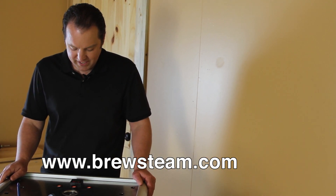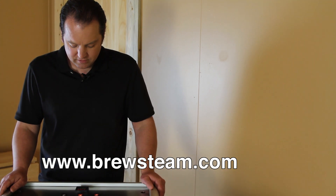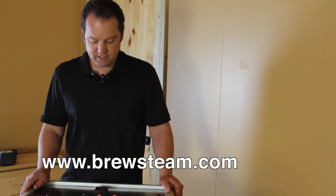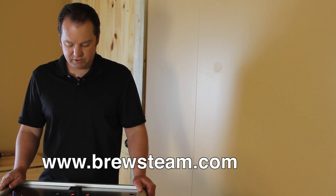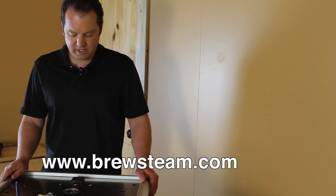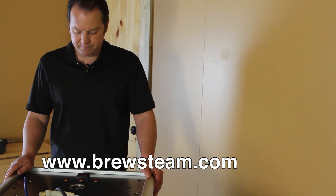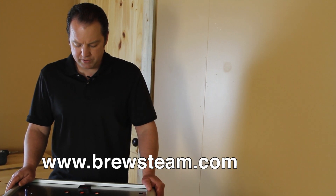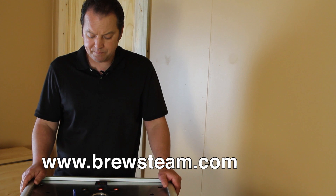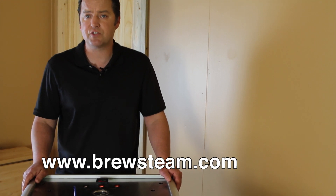Right now I'm at 210, and now it's going to drop down. Every once in a while you also hear the auto-fill happening — the automatic filling of the boiler. So it was 209, now it's 210. Now it's going to drop down a little bit. There it is — we're hitting right on. You can see it fine-tuning. What they call auto-tuning — that's what it's technically called. Now it's 209, 209.3, 209.6. On our pressure gauge, because we've got 10,000 watts, this thing can really produce a tremendous amount of steam without ever running out. What you don't want is a system that gets low on steam, because when you get low on steam you get a lot of condensation.